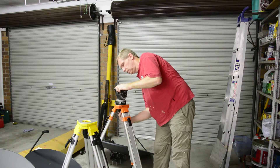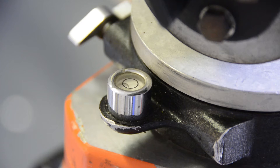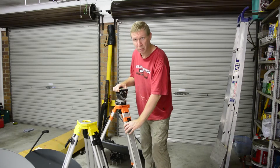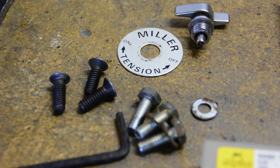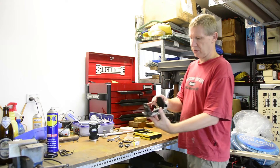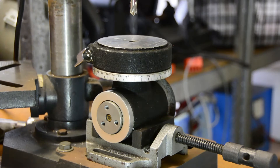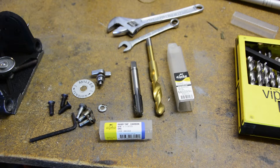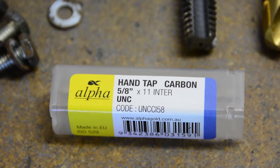This particular model also has a bubble on it, so it's nice to know when the head is actually level, and you can adjust the legs on your tripod accordingly. I've already separated the two main parts of the head — there are only three bolts either side to do that. I've put it in the vise. Make sure you level the thing in both planes using a spirit level before you drill. We're going to drill it out up to 14mm, then tap it with a 5/8"-11 turns per inch tap.